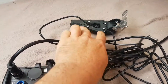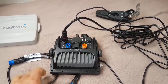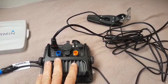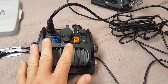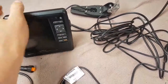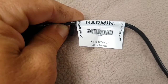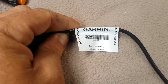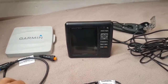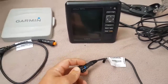XID is a chip or something built into the transducer that tells the unit what model and type of transducer it is. If you buy the transducer that comes with the machine, the machine knows exactly what transducer has been supplied. But if you buy an aftermarket one, this GT20 with its specific part number is different to the GT20 that's supplied with the unit.